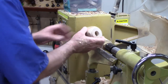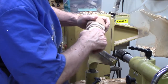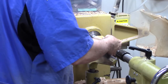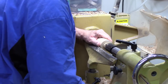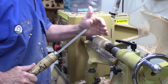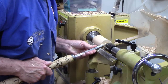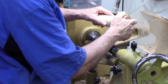Now let's test that. We're going to take the blank that we drilled with the one-inch hole and just make sure we've got a pretty snug fit. That looks pretty good, maybe just a little bit tight in the back. So let's refine that just a bit. I can see it's tapered down just a little too much, so I'm going to come in from the beginning and take a light cut right through the back. Yep, that'll work — nice snug fit.